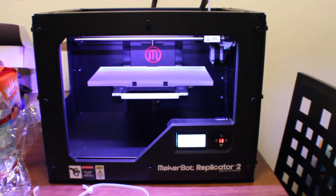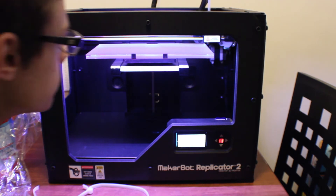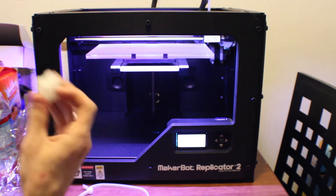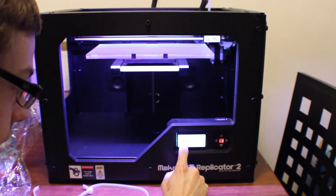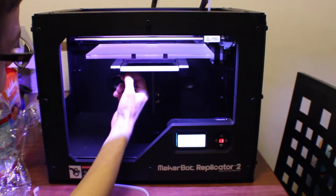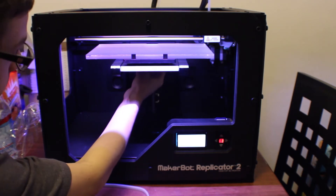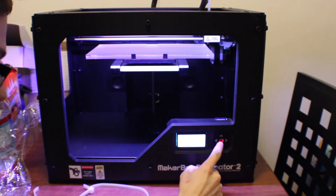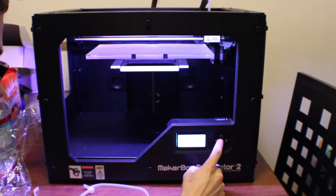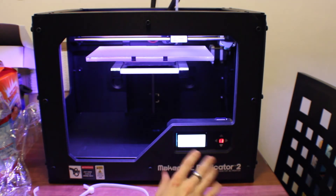I've been watching problems they've had with these — it's with the end stop switches where it wouldn't stop completely. It looks like the last color to run through this is blue, but there are no blue pieces here. Strange. Tighten each of the three knobs under the platform about four turns — righty tighty. I'm going to move my extruder around different points so you can check the height at each point. Loosen the specific knob until the nozzle almost touches the build plate. The nozzle is at the right height when a thin piece of paper will slide between the nozzle and build plate with some friction. That's the part that really gets me confused.